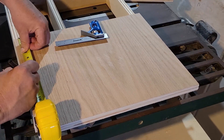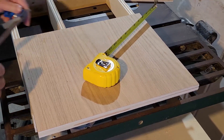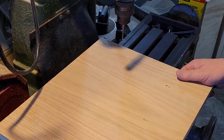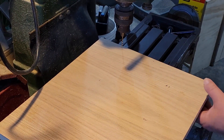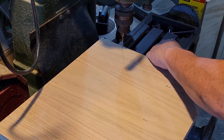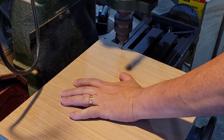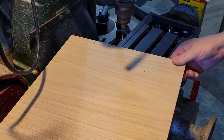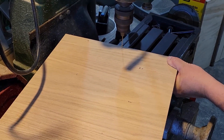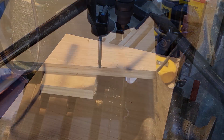What I'm going to do is glue and screw this in place. I'll take some of those screws I just removed and use them here. I'll mark out all the holes, run the drill bit through, then set the depth stop on the mill and use a Forstner bit to make nice flat-bottom holes. Using those screws with the flat heads means I can put a lot of force on this, keep it tight on the box, and not worry about voids or screws stripping.